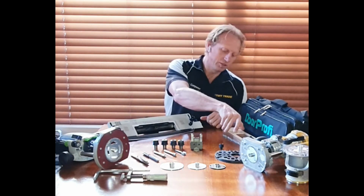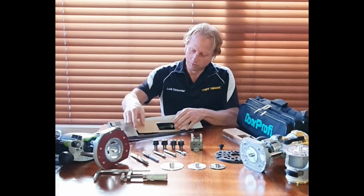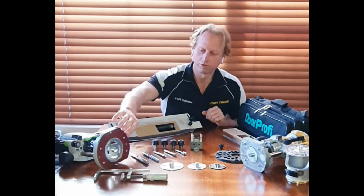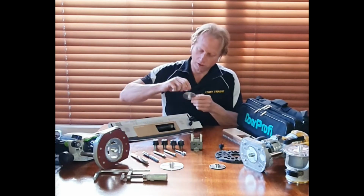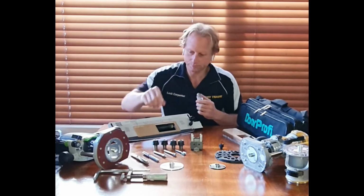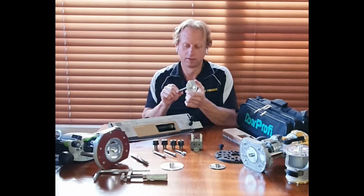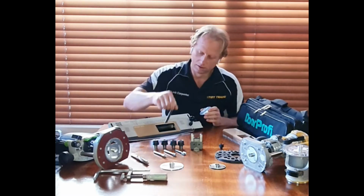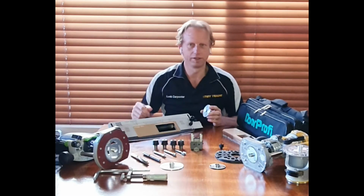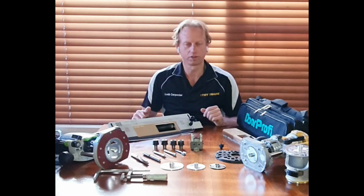So pretty much we work with a template like that, drops in place, and then you need a copy ring on the base of your router which follows the shape of the template without damaging it. We use a 12mm cutter and a 16mm guide with the capability of using plunge cuts, whereas a normal trimmer or a flush cut bit can't plunge. As soon as you change the height up and down, it's just not going to work.